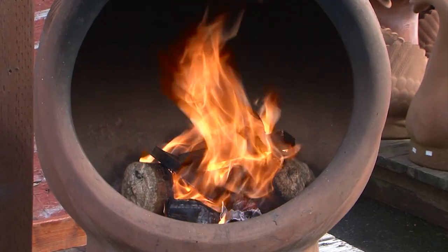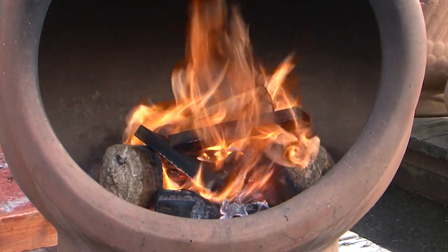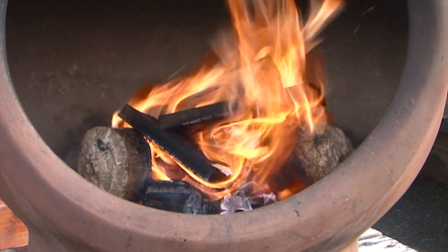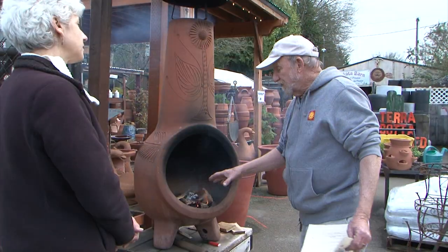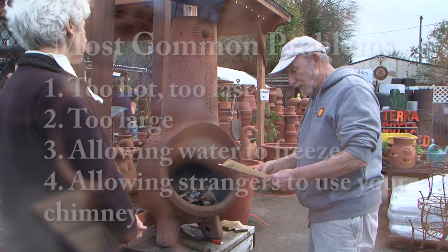Don't be surprised if your chimney tray cracks. Your chimney tray takes the brunt of all the direct heat but protects the bottom of the fireplace. Do not burn in there without your fireplace tray. Do not use sand or gravel — just the fireplace tray. You'll be just fine even if it breaks in two, as long as you have the fireplace tray in there.